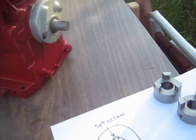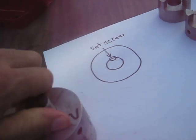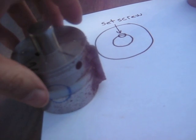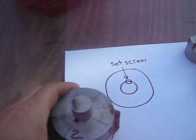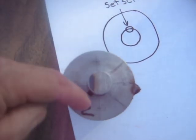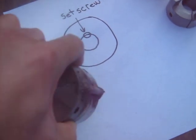The way I actually made it was I machined the discs and the UHMW, then stuck a piece of rod down it to align it. Welded these two bars to it and proceeded to melt some of the plastic. Then set it in a mill and put four holes in it, drilled larger and countersunk two of them, then flipped it upside down and countersunk the other two.